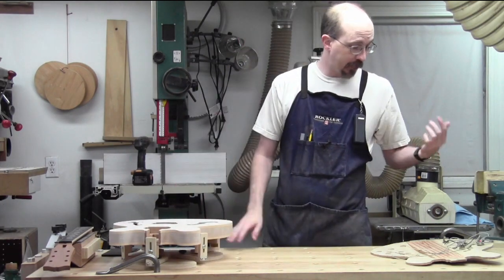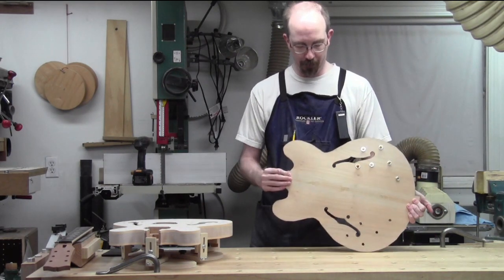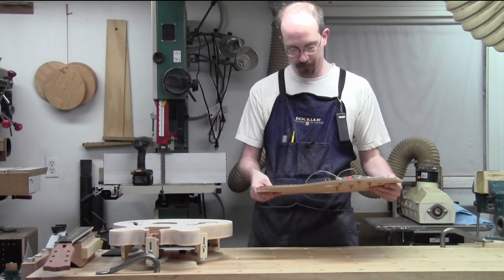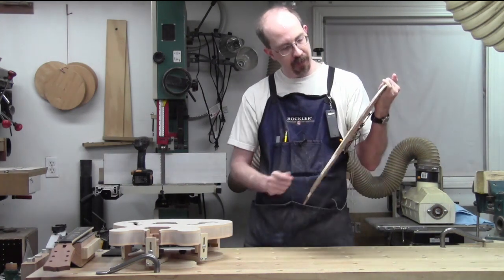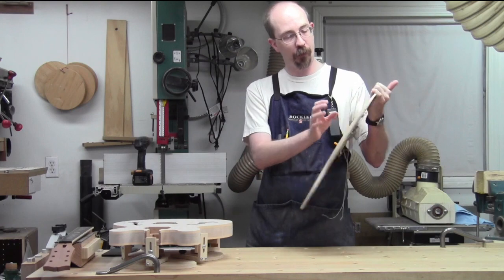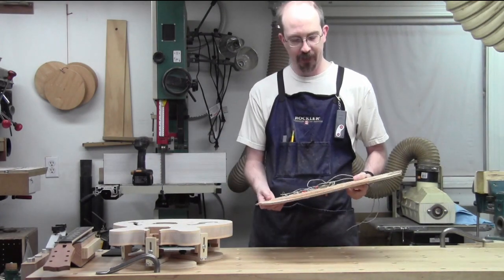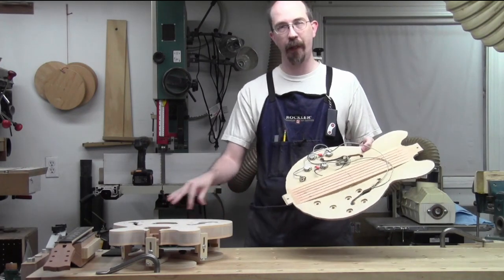This is one of my test panels for doing the curved lamination glue-up - it's become my little guinea pig panel. I tested the shim out on it, tested routing the F-holes on it. I also tested my ability to tell a left-handed guitar from a right-handed guitar - I drilled all the electronics holes on this side because I was upside down. I was thinking 'that's a right-handed,' but that was the inside of the guitar, so I drilled out left-handed holes. My excuse is I now have a wiring template for both a lefty and a righty ES-335.